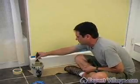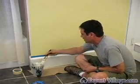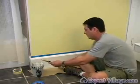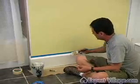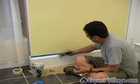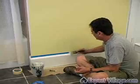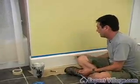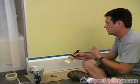And after that, it's really just very straightforward. Things like a doorstop are a lot easier to just remove than they are to tape around. The thing you want to do with trim paint is just to put on a light coat and don't overwork it. There are flattening agents in the paint which are going to cause it to flatten out.